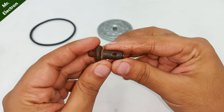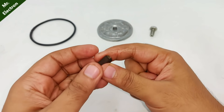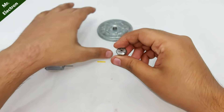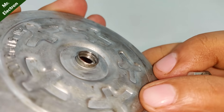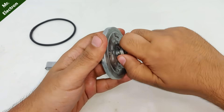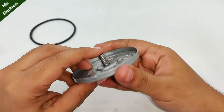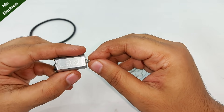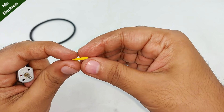Now guys, I performed the center drilling in this piece but it was hollow from inside, so I cannot use it anymore. I did the same thing to this bolt — center drilling — and this bolt will be used as the shaft for this metal disc. Now if you look closely, I have already made the threads and it goes really smooth like this. The bore size of the hole in this bolt is a little bigger than the shaft of this motor that I just salvaged from the music drive, so what I'm going to do is use this heat shrink sleeve.